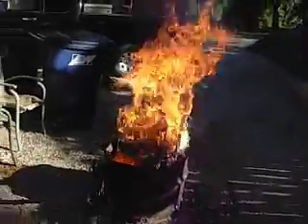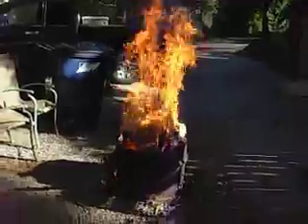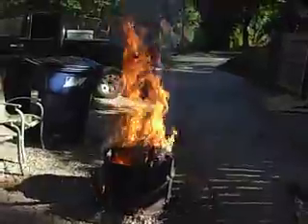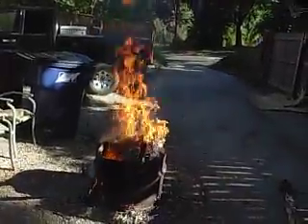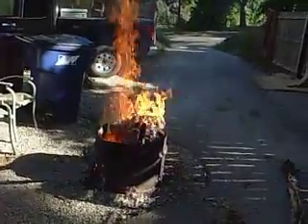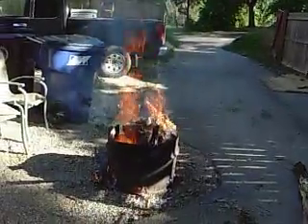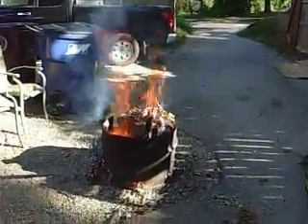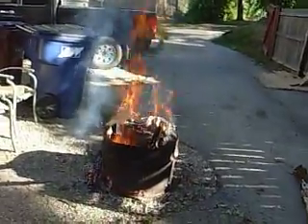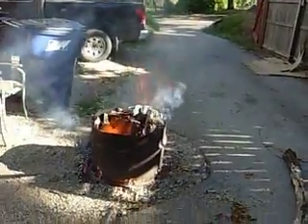Wow, that's hot. I have like 12 files in there and two saw blades, so I'm gonna be cutting out some more blades out of the saw blades. What's going on right now is I'm basically taking the hardness out of the metal — out of the files — so I can work it, drill holes in it, grind it down easier.